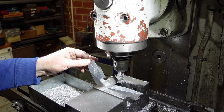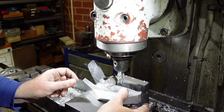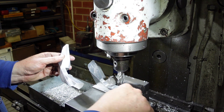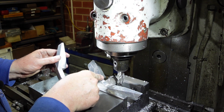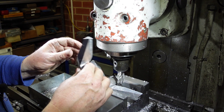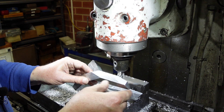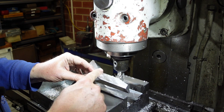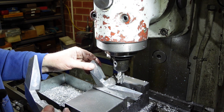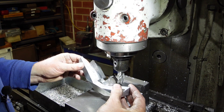I'm slightly getting there. Once again with the block I held that in the vice, and I've trimmed up the two ends. Then I've done the inside on this one and I've got to flip it around and do the outside — the short side — then it'll be a matter of flipping it onto its back and doing the outsides of the leg. The block here to hold it is a wonderful bodge if you're ever stuck in this sort of situation with funny curvy parts.